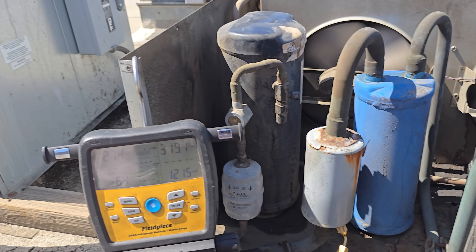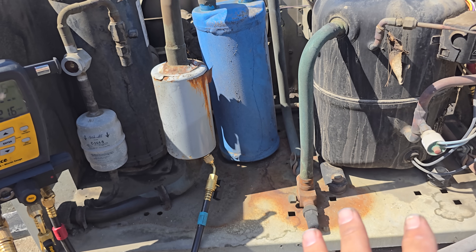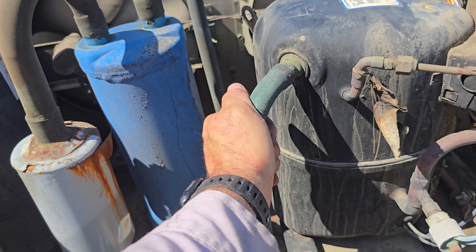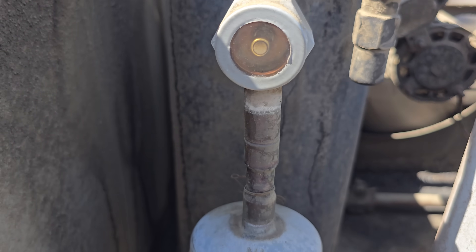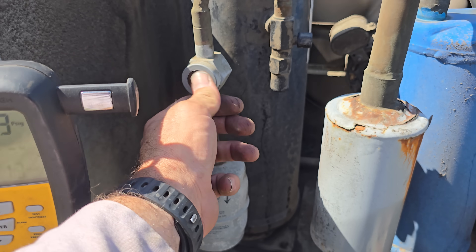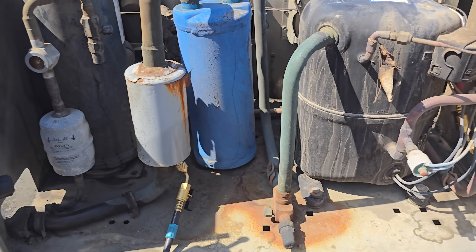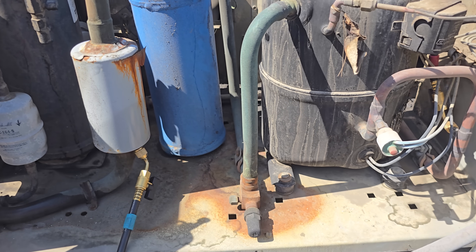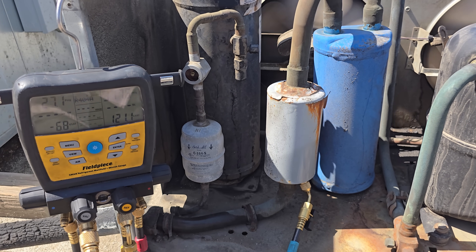We're cleaning up and heading down to the evaporators to see if they're running. Our evaporator fan motors are running - we confirmed all three. The coil is getting cold and starting to cool off the suction line. We have a clear sight glass coming back - the sight glass is a little burnt from a dryer change, but everything looks good. It's going to take a while to come down to temperature, so we're not going to hang around. We've got a clean condenser, new condenser fan motor, clear sight glass, and evaporator fan motors are running.